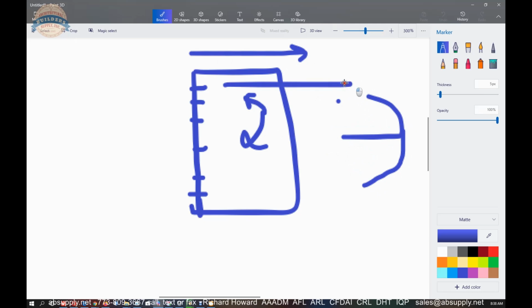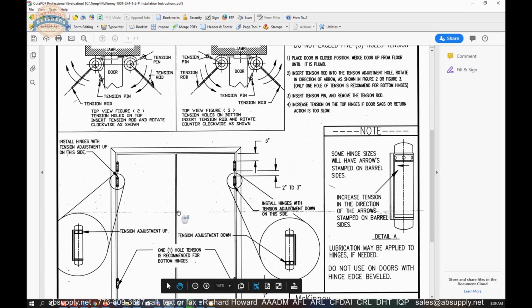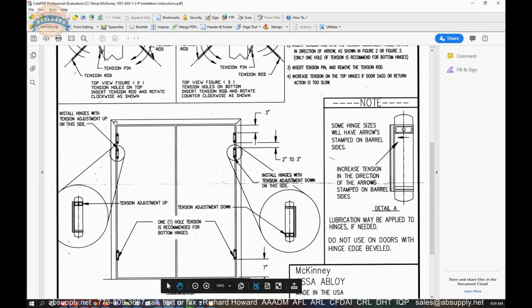because that weight again is pulling on the door this way at all times. And then you put the force of actually operating the door in and out. Yeah, you can count on that door possibly hitting the jamb. And I would think at that point, 3/8 of an inch is where I would start. And if you're doing more than one, you'll make adjustments in the following ones. This goes to talk about that soldier stacking we talked about earlier. This would be considered best practice for doors.